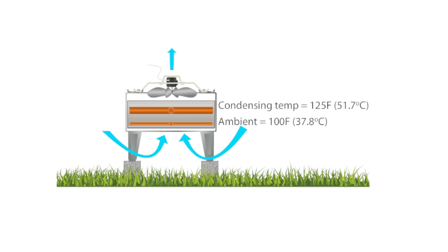On the high side, the control function for a high pressure control is for fan control — in other words you're controlling the fans based on pressure in the condenser. Picture a hot day: you've got lots of load, your coolers and freezers are all loaded, you're trying to reject as much heat as possible and keep the pressure and temperatures in your condenser as low as possible because it's a hundred degrees outside, so you want lots of airflow.